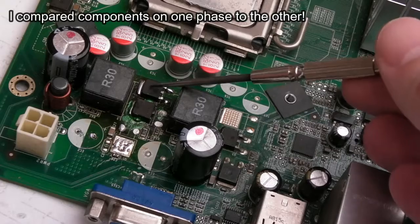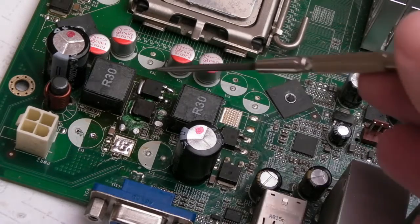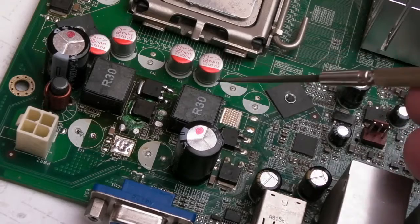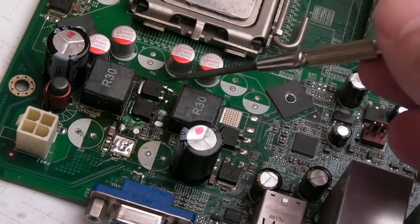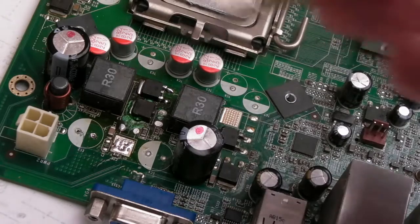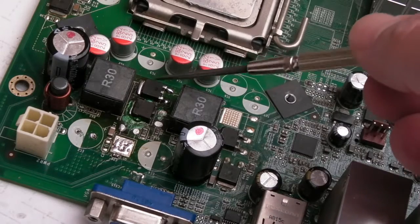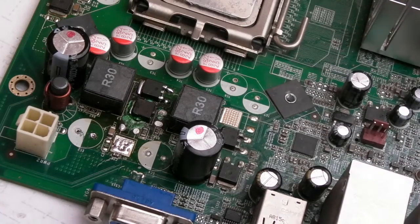In some circuits, you've got to impedance match MOSFETs. So that means testing them, you know, in terms of the gain and all that sort of thing. So one thought I did have is, we could have an imbalanced thing here, the charge pump or whatever, how this works. It could be slightly imbalanced as a result of having an equivalent here, but I can't get the original ones.